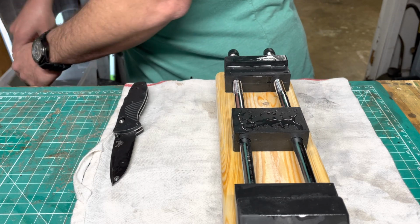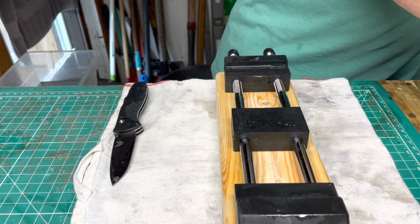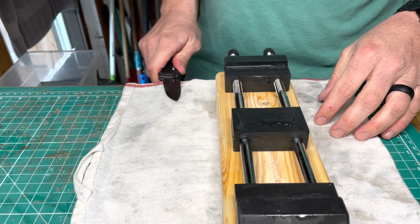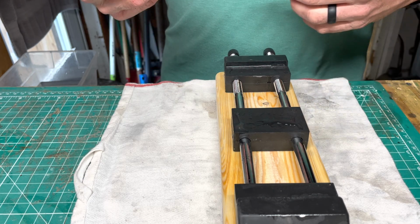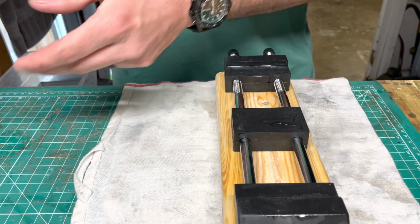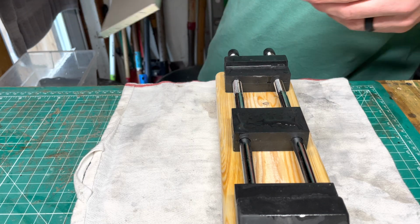A lot of folks seem to think they sharpen on a 600 grit diamond plate and they get that toothy edge. Well, you're really just getting deeper scratches. It's just a rougher edge. It has no more teeth than a properly done polished or finer edge. We'll do a video about abrasives coming up, but we'll go ahead and take this one too.